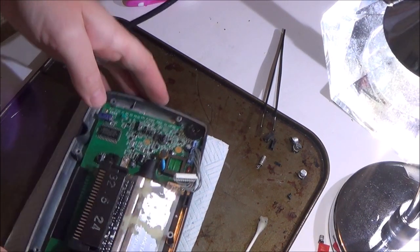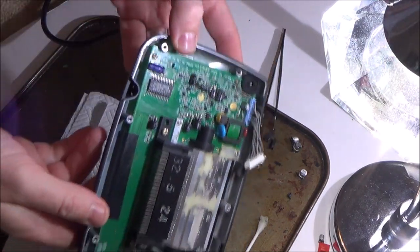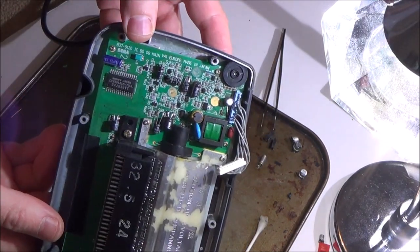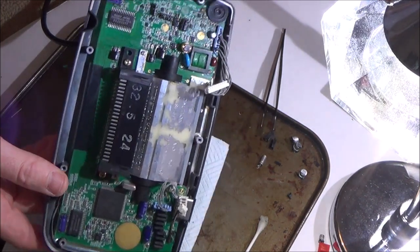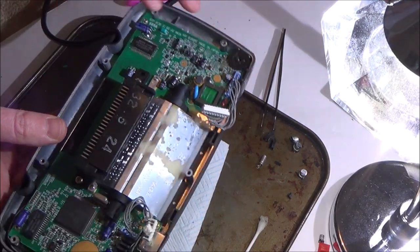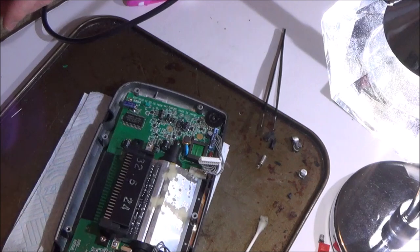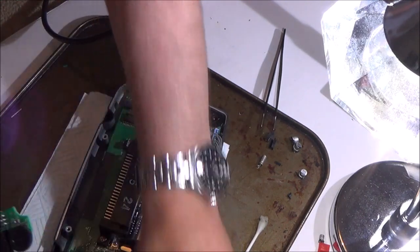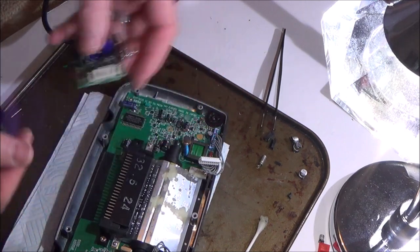Right, okay, so that is all the capacitors done. Yeah, so I've got them all here. And I am happy with the way it's come out. It wasn't really easy, but it wasn't really hard either. It was okay, you know, I'd be happy doing that again. So what I'm going to do now is put it back together. So put this little soundboard back in, put the power board back in, and then put it all back together,